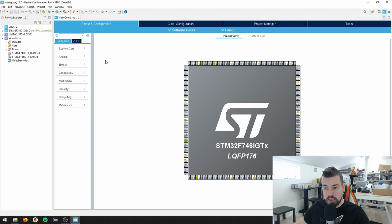I'm going to say this multiple times: CubeIDE or CubeMX is a hardware configurator. CubeMX only configures the hardware - which pins are assigned to which function and stuff like that. It does not give you any software initialization. So if you're coming from a project where you used the TouchGFX designer with an application template, TouchGFX designer would actually include the software configuration, like setting up timings for the display and SDRAM. You do not get this when you're doing a custom project. You have to include everything by yourself.